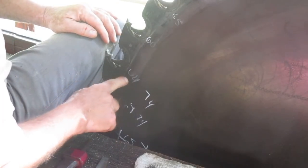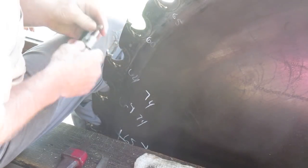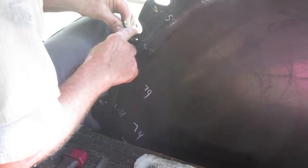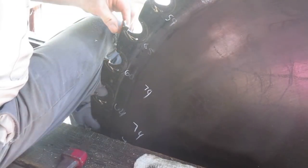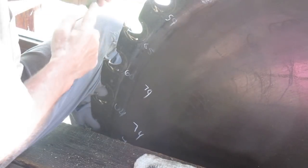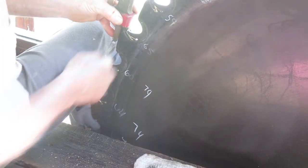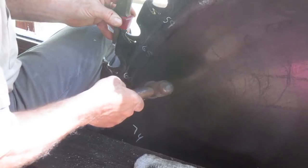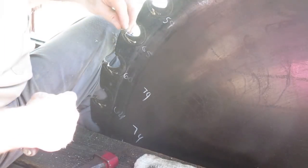So I know this one here is 64, this one here is 60. All I did to achieve that is put this on there — it looks like I already swedged that one because now it's 74. So I'll just write 74, I'm happy with that. It's sharpened. What you do is you bring it around — I sharpen them first, then you put the round side on. This one here has a gauge, a little edge on it. I already put a little oil on this thing. Try to get it in the middle the best you can, and this lines them up so they're all pretty consistent. Because I'm going from 65 to 74, I'll just give it a couple hits, then flip it around to straighten the tooth out, and then re-sharpen.